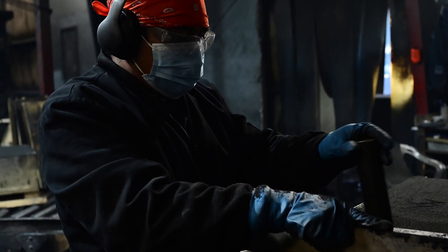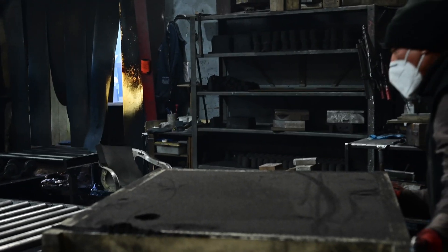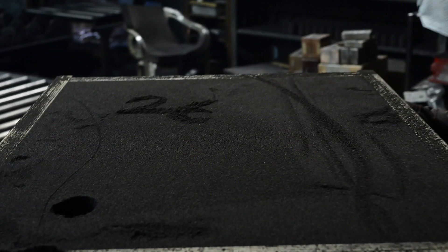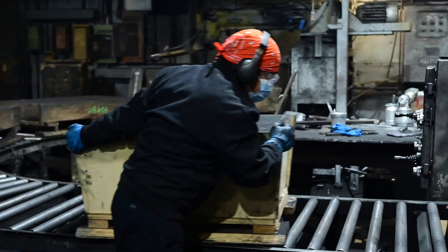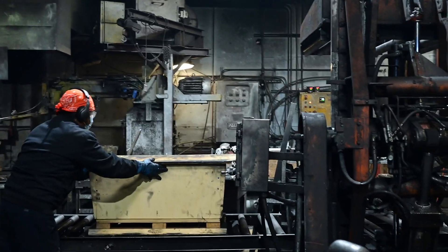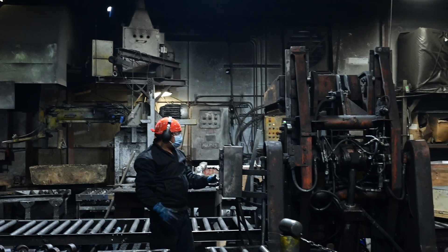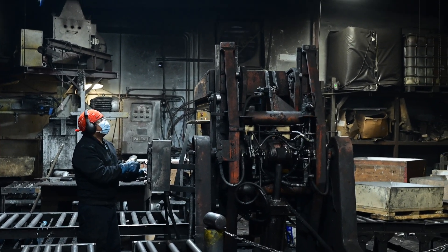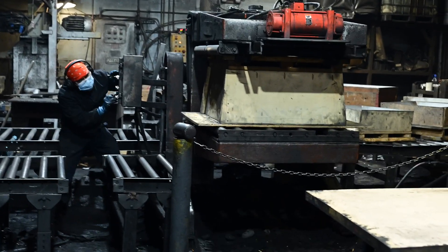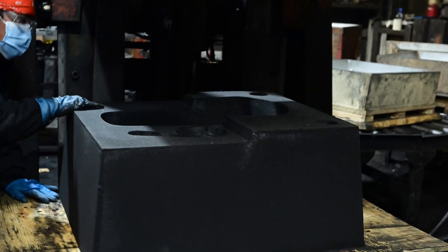There are only a few of those machines in the United States, and that's not how we make the K3. However, it actually is how we started the process of K3, because we didn't think it would be possible to create the forms and patterns for the shape of the K3 turntable body, and most importantly, the voids inside the body. But we found that the 3D printed sand molds were actually not as good — because of the nature of how the sand is compacted and constructed — as making traditional patterns. So we went to a great deal of expense to create the forms you're seeing, which are being packed with black sand, flipped over to get to the other side, to create the molds for K3.